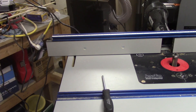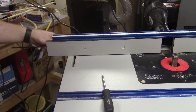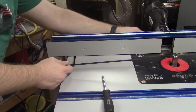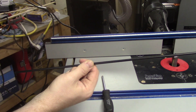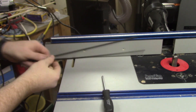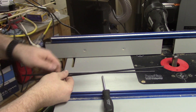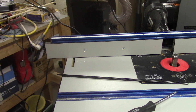The key to this whole operation lives in a storage rack on the fence of this router table, and they are in the form of these two rods. These two small rods get placed as a wedge in this side of the fence and in the outfeed fence, and then we are able to edge joint our board.